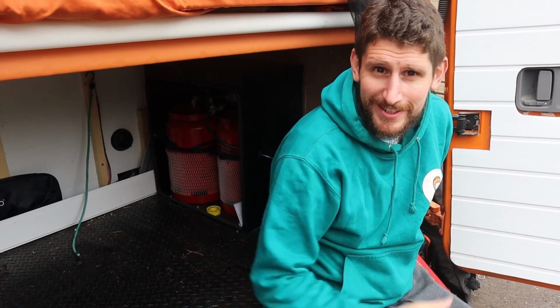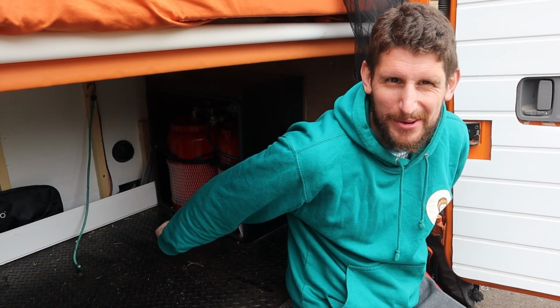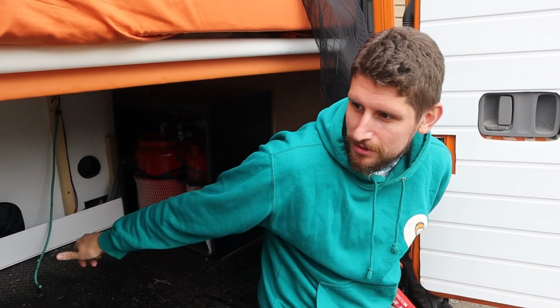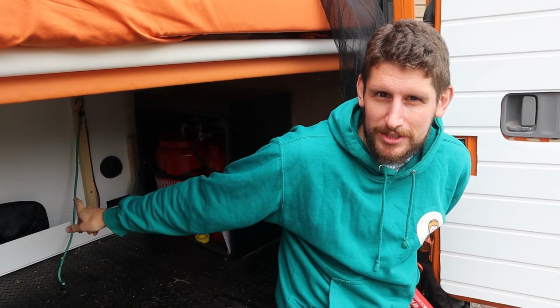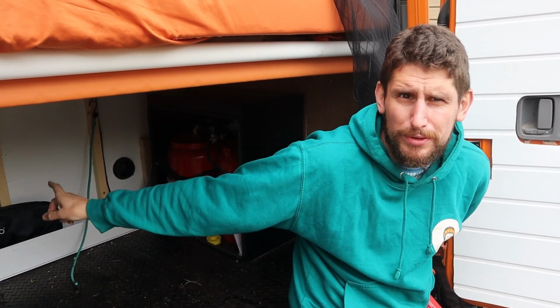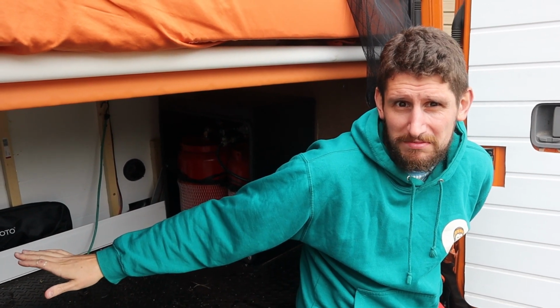So garage emptied, we can actually get to our gas now, which is a really bad design when we actually think about it. And I've closed the valves off, and now I just need to burn off the remainder of the gas that's in the pipe from the bottles to the cooker, and then that means they'll be safe to remove.